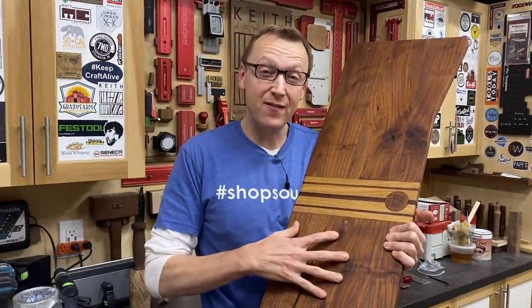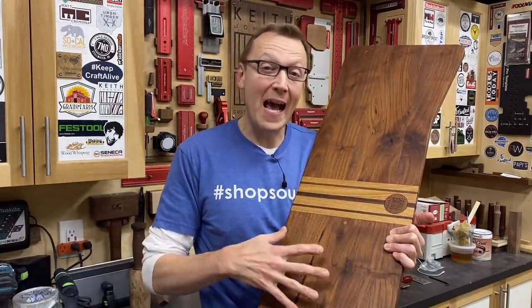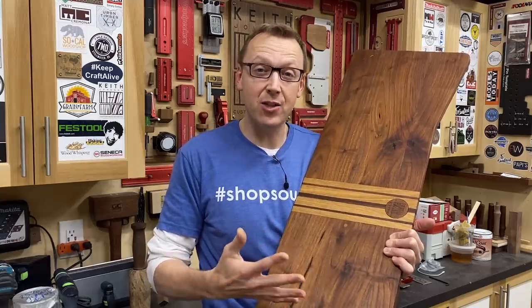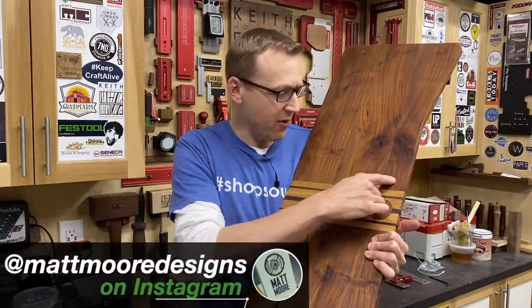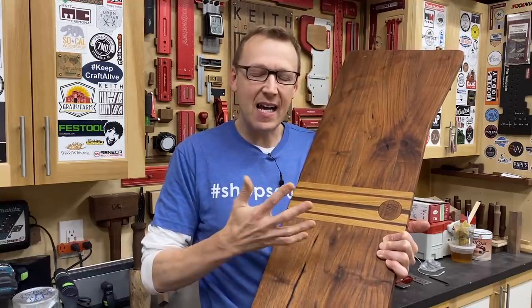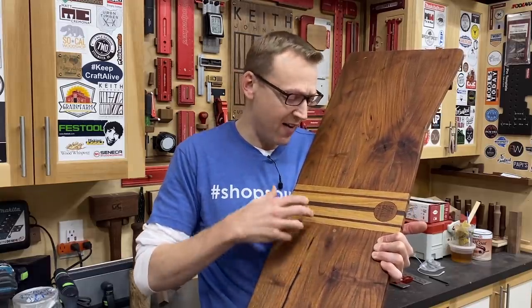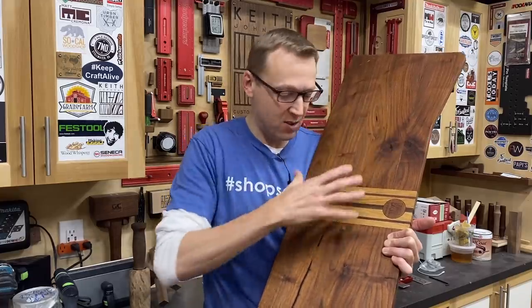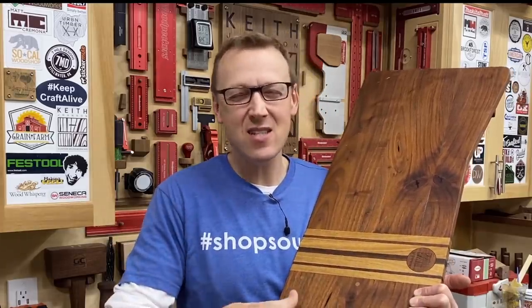Okay, now it's confession time. I actually built and filmed the footage for this project over a year ago — I just never posted it on YouTube. But as I was building it, I was posting progress shots on my Instagram feed. And that's when my buddy Matt Moore asked, hey, aren't you concerned about wood movement? I mean, you have end grain of the walnut glued directly to the long grain of the white oak. And I'll be honest, I hadn't even considered it, and I'm quite embarrassed by it. I think I was so hung up on the design of having these cool sporty stripes meet this way with the walnut that it just didn't occur to me. So as I started thinking, since this is for myself — who really cares? Let's just see what happens.